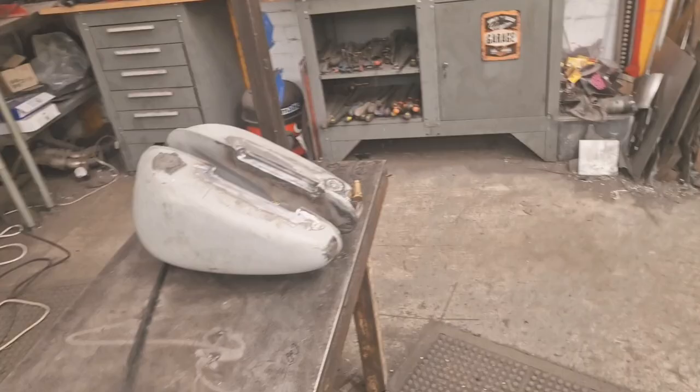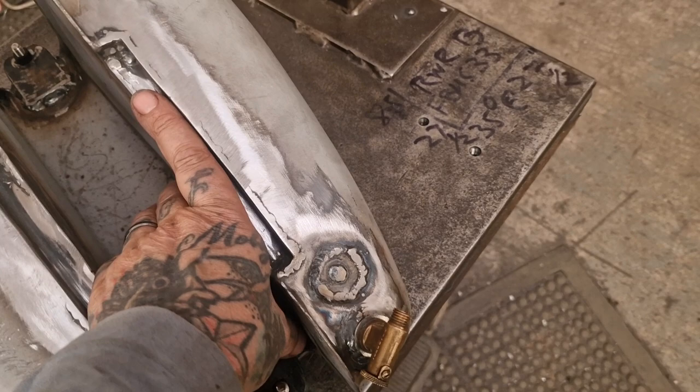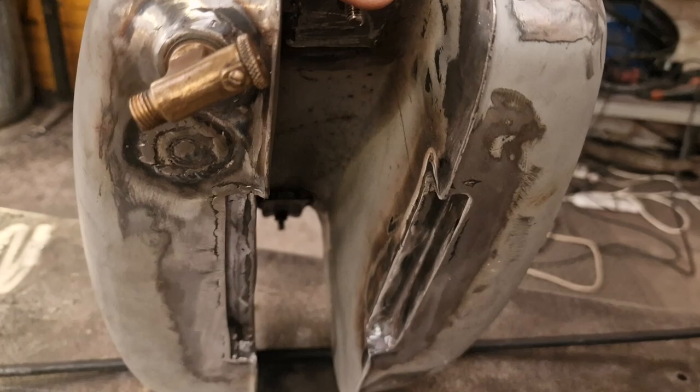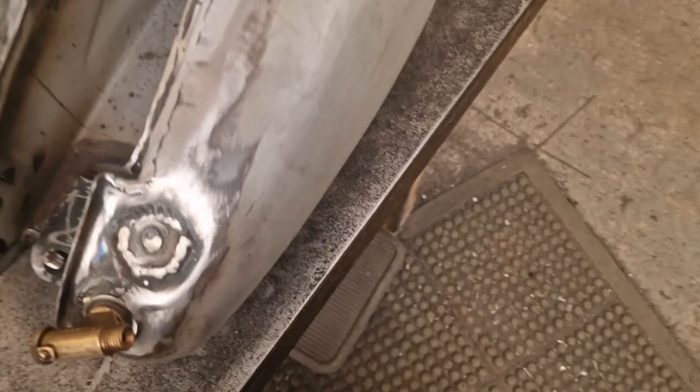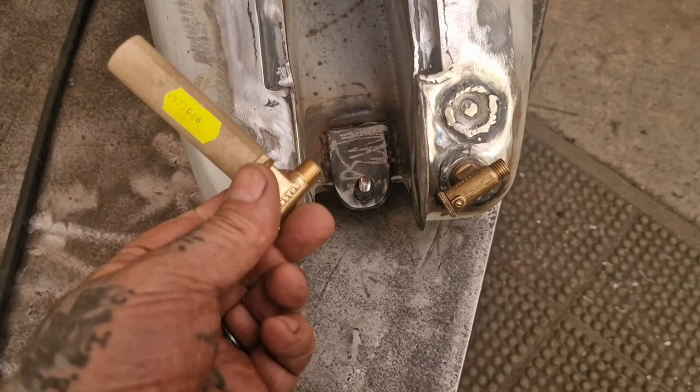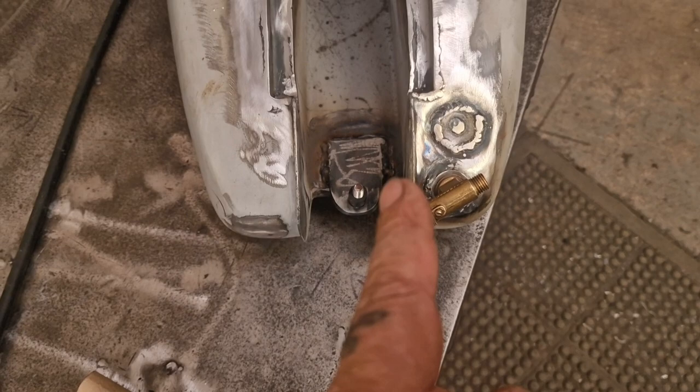Okay, muchachos, you may remember the Yamaha 650 that we fitted this fuel tank on, and lots of people quite rightly said about fitting a balance pipe because the two halves of the tank are so split by the divide line. Now, I spoke to Richard, the owner, and he has gone for his solution, which I think is a really good solution, is twin fuel taps. So we're going to set another fuel tap in here, and then it's going to run them to a T to the carb. So you can have one on, both on, none on, etc.